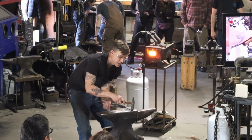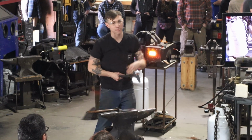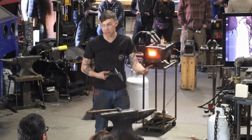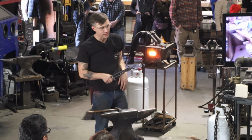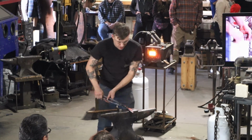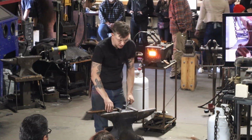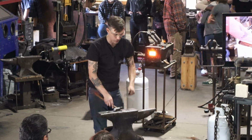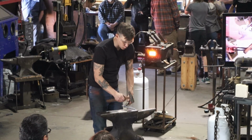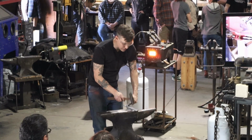And then you got Damascus to think about. Some Damascus patterns, you need to grind really deep down into them to make them look cool, because they're just kind of lines on the surface but swirly in the middle. And so sometimes we'll make decisions about how much we're going to grind on the thing based on the pattern. These San Mai guys like Greg, they want to have the absolute perfect amount of core steel sticking out. So they got to do a few test blades to know how much to leave, you know?